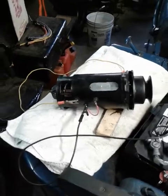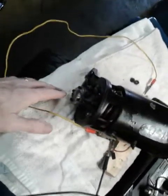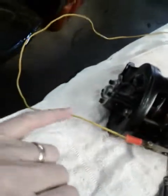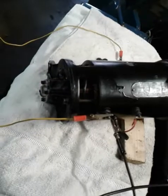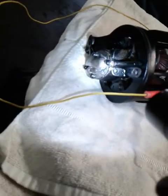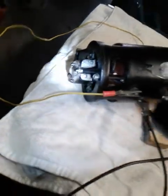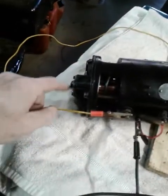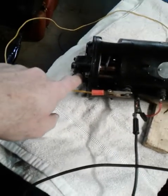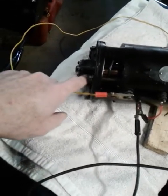So now I'm back to the end. I've got it all assembled. I've got the commutator end lubrication done. I've got the felt wick in there and oiled. One thing to note — and I know it's kind of hard to see here — there's a little hole, what looks like a hole right in the top here, and that is not where an oiler goes. A lot of people think that, and I thought that initially, that there's a little flip-top oiler that goes there, but that's not correct. It is for a plug. When they manufactured it, they had to bore a hole straight down for that felt, and that's the only way they could access it. So they just put a plug in that hole.